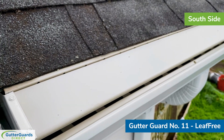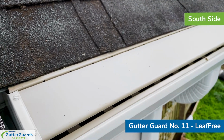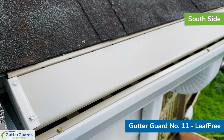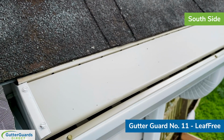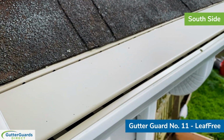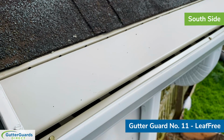So it's a relatively straightforward panel to install. It has a male-female connector on it, so each end interlocks to the next. In this case, since we just have one panel up here, we've put end caps on both sides of it just to prevent any leaves and debris from skirting in on the side.